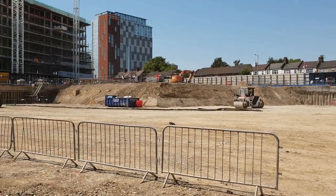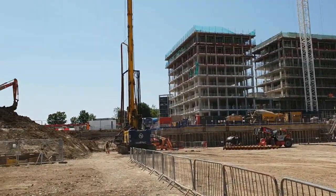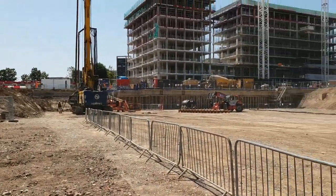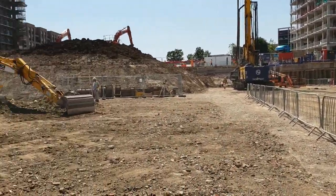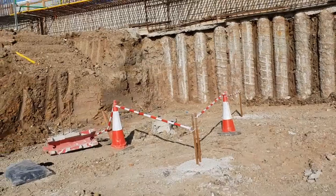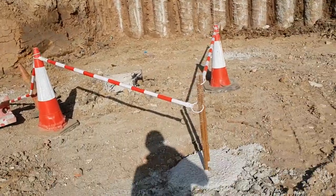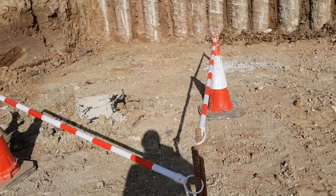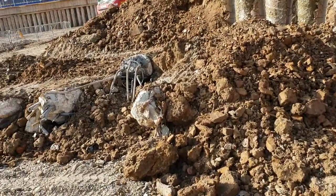That pile mat there is quite a bit thicker — one meter deep. As you can see, we've got the piling rig set up, so piling is going to start probably today. They've got the drum agitator set up and ready. On the next video I'm going to show you more about the piling. Down in the basement you can see some piles already done — that's going to be the testing pile. I'll show you how the test is done when the guys come. Some piles are already broken down and we're reducing the level to the formation level of 42.160.